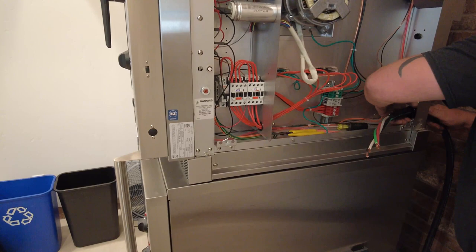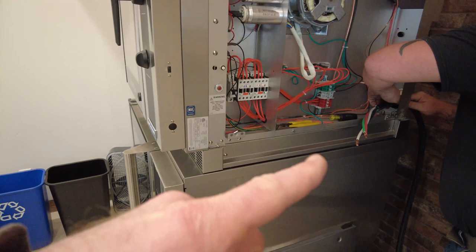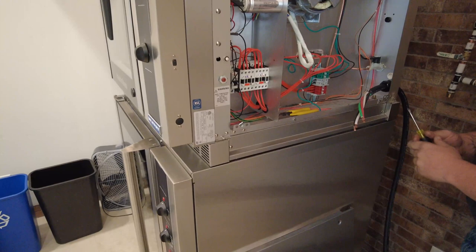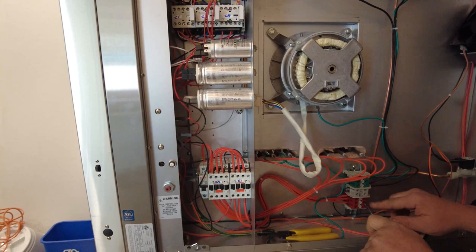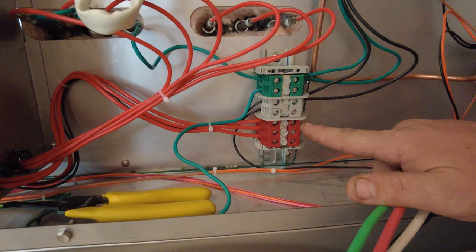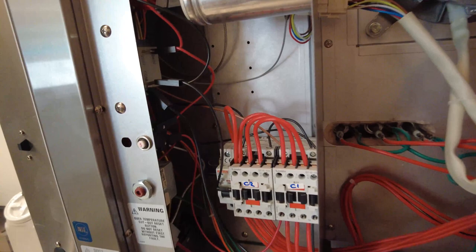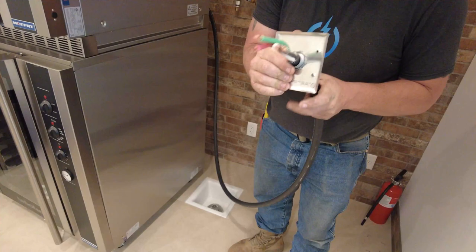We want to keep it at a good 110 degrees inside there so you can proof it. That's the proofer down there — the proofer is over here, and this is the big oven right here. The electrical is beefy for this oven, and the electrical for the proofer is just the 20 amp. What's nice about these ovens is that they're wired very simply. You've got a little distribution block right here — all you've got is L1, L2, and L3, which are all power, then neutral, and then ground. It's super simple. Over here they have a setting for 240 volt or 208 — you just move this jumper over.